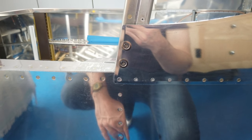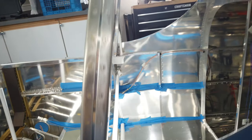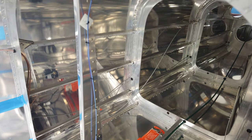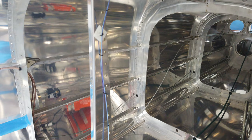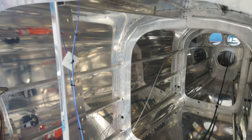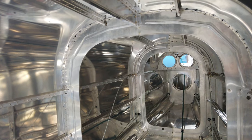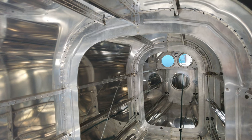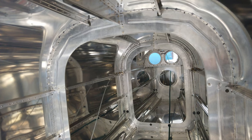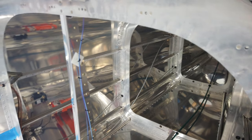That skin is now done and riveted. I also have the seat belt cables now in place — those are attached all the way in the back to their appropriate brackets, one on each side. The brackets are installed, the cables are in. I use clevis pins and cotter pins to attach the cables to the mounting bracket.